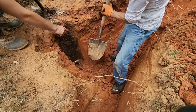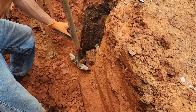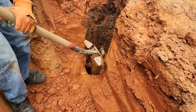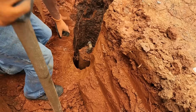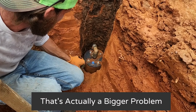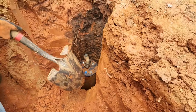Take the shovel and just dig. That's all a piece of it — that's a rock right there. We are there. I almost need something to hold it over while I do it. Look, it stays. All we really got to do is be able to get a wire brush around it and clean the dirt off of it. It keeps you loose. We're just going to clean around it a little bit more to where we can get the transition around it. We're going to take this little area off right here, then take the wire brush, clean around it, and slip the transition coupling over.